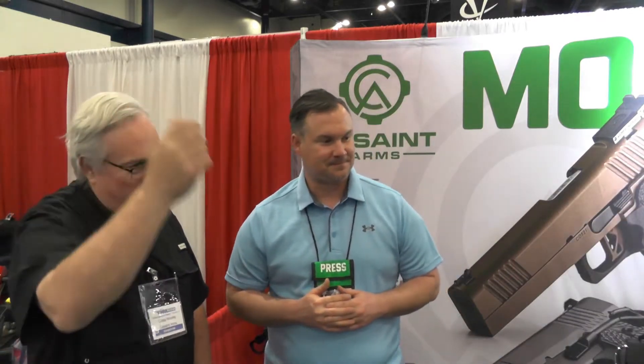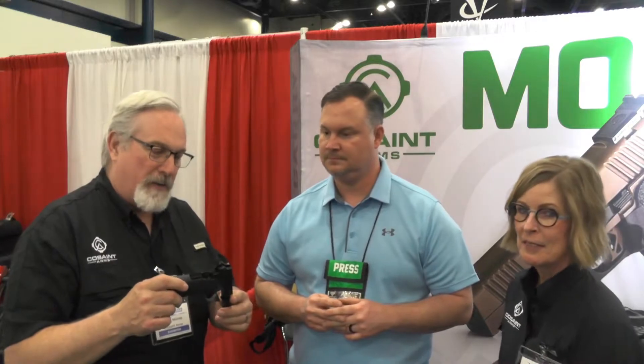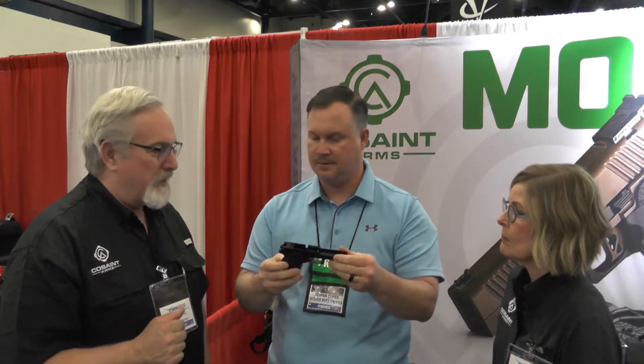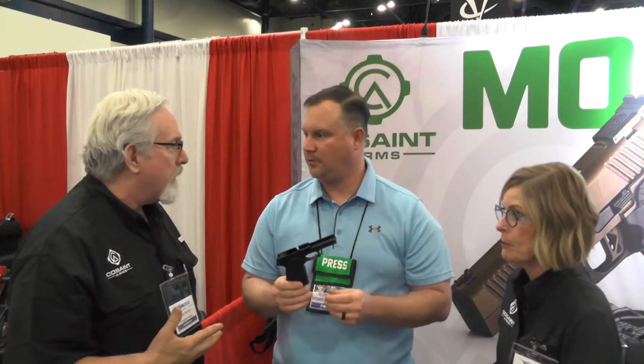All of our guns start out with a modular system — we have a metal or alloy frame with a polymer grip. When you combine those two, it allows for a lot of flexibility and variety in the guns, and it allows the gun to shoot flat. Are you the only one that uses this system? There are absolutely other companies that do this — mostly the 2011 or double stacks on the market have that same system. This is a single stack, but we have double stacks built the same way. By separating the frame and grip, the energy doesn't go to the grip, so the muzzle stays down and you get good solid accuracy with repeat rounds.